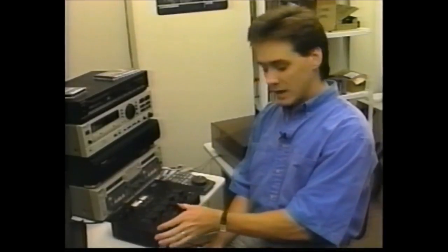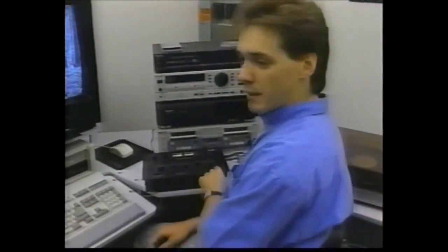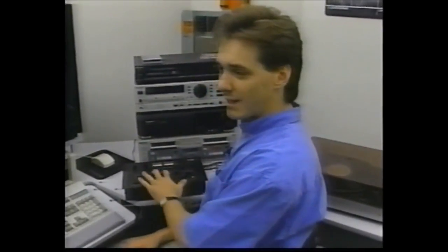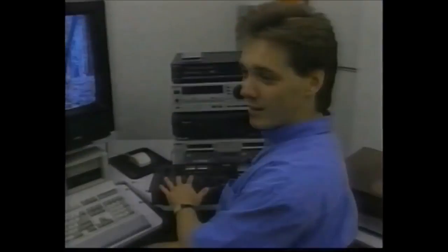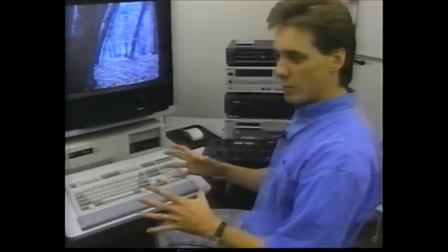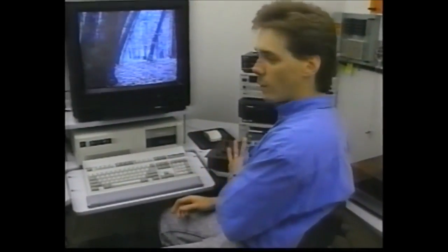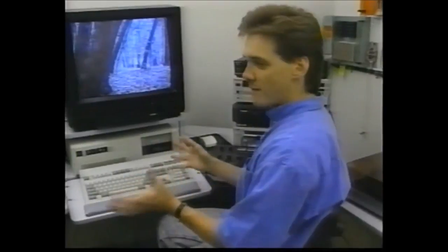It can crossfade between two sources. There's even a microphone input for narration. So you really have a lot of control. This is like your audio editor. I think the trend nowadays with SEGs is that they usually encompass some type of audio mixing capability in them as well. That's becoming a lot more common. Many video mixers have a small audio mixing section, like you said. They don't offer quite as much control as this, but then you have everything in one box.